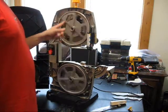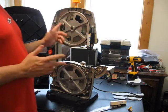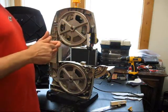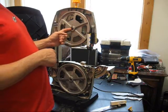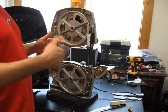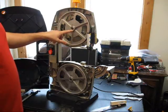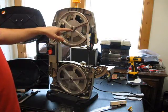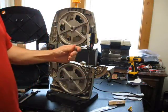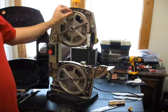For balancing: when I took this wheel off by removing the E-clip and the Allen bolt, I found that the wheel was a little unbalanced. I bought this used, even though it was new, and the back bearing looks a little bound up. I used a metal screw to spin it, making sure it was on the outer bearing since the inner one looked rough — possibly from heat buildup. I got some Chavant clay — a non-sulfurated plastiline — and just mashed it in there, and it seemed to help. It didn't vibrate as much.